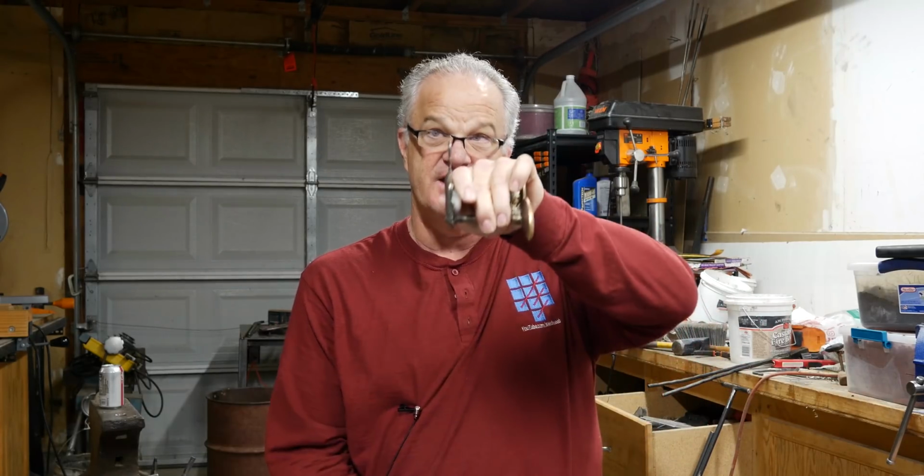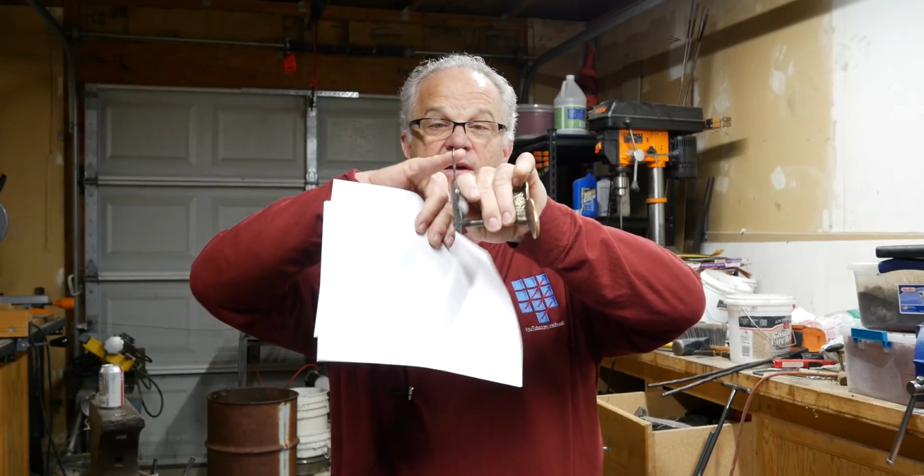The aluminum stuff, the thin stuff I'm doing, yeah, there's no feeder necessary on that. Even on the bronze stuff, there's really no. This thing that I cast, this is the finished thickness of the part, this little piece right here. And it doesn't need a feeder.